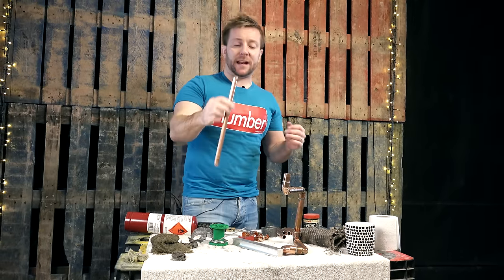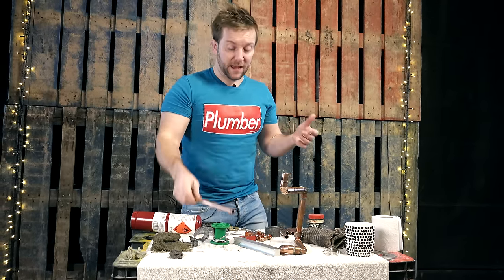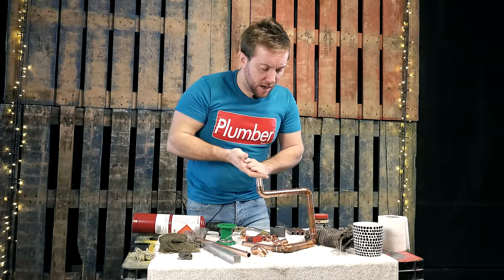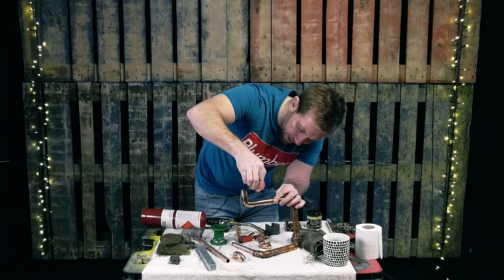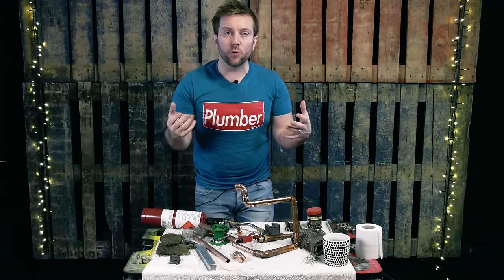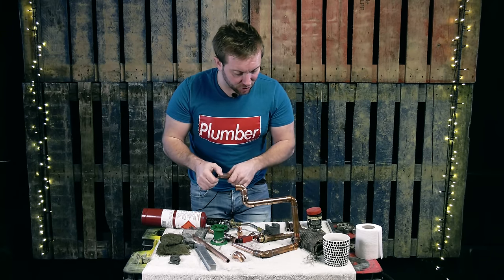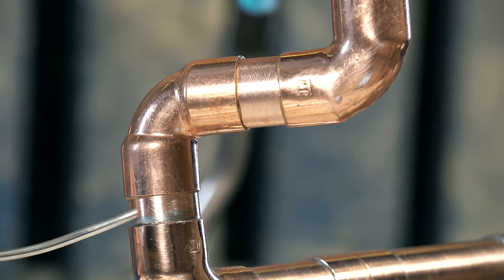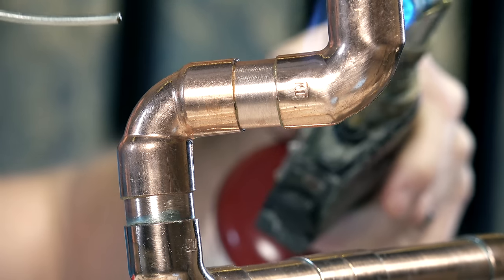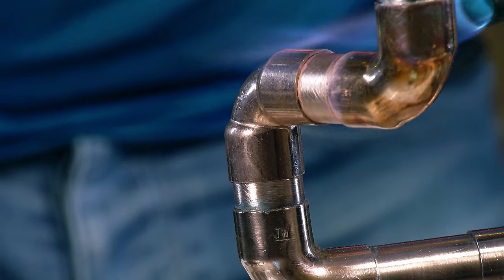What I'm gonna do is make a little plate up quickly where we've got an upright pipe, and then we're gonna do loads of solders up here and just see whether we get them to run or not. We'll just get this fitting cleaned up here. I'm just gonna use a little bit of Laco on this one, just cleaning that fitting up nicely. I want to use old pipe to prove how much you have to concentrate on cleaning a fitting. What I like to try and do is if I'm doing this joint at the bottom, I like to do that joint last. So we're gonna heat up our top fitting going down to our bottom pipe. Just gonna get that going in here, and we're gonna do that top one first.